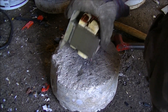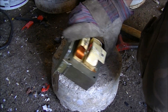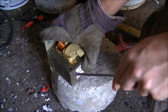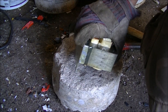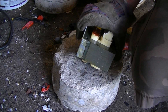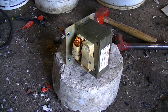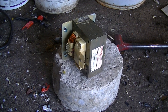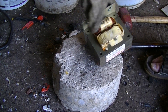This is a large transformer out of a microwave oven. On this transformer the bottom half and the top half are separate but they're held together with welds — there's a weld on that side and a weld on this side. They're not that hard to crack; you can usually just stand them up and hit them with a hammer a few times and they usually break apart.